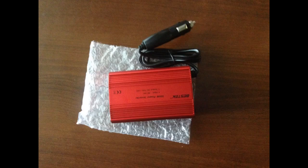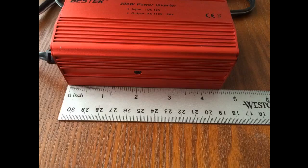I just received this inverter a few days ago. The AC outlets work great. I will definitely try it out on my next power outage. The only two things I don't like are that the cigarette lighter plug has the cord directly wired without a fuse, and the 40-amp fuse the unit has is inside, soldered to its PC board — see picture. That will make it hard to replace the fuse. Other than that, the inverter is a great price and was shipped to me in 8 days.